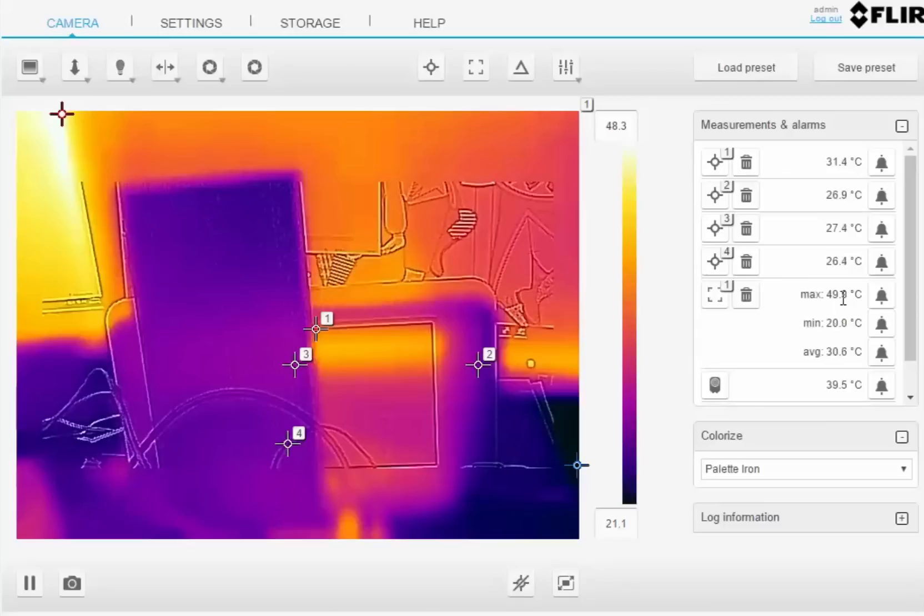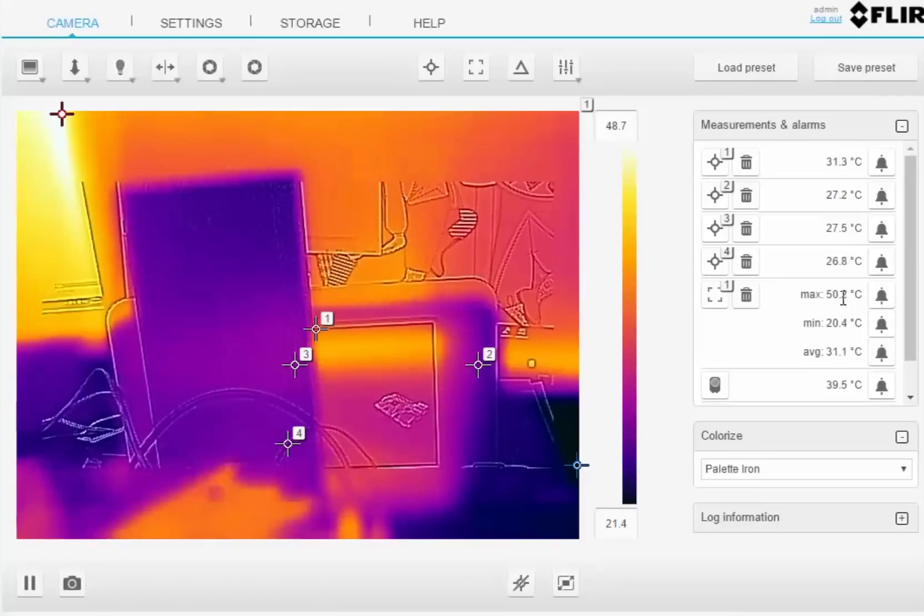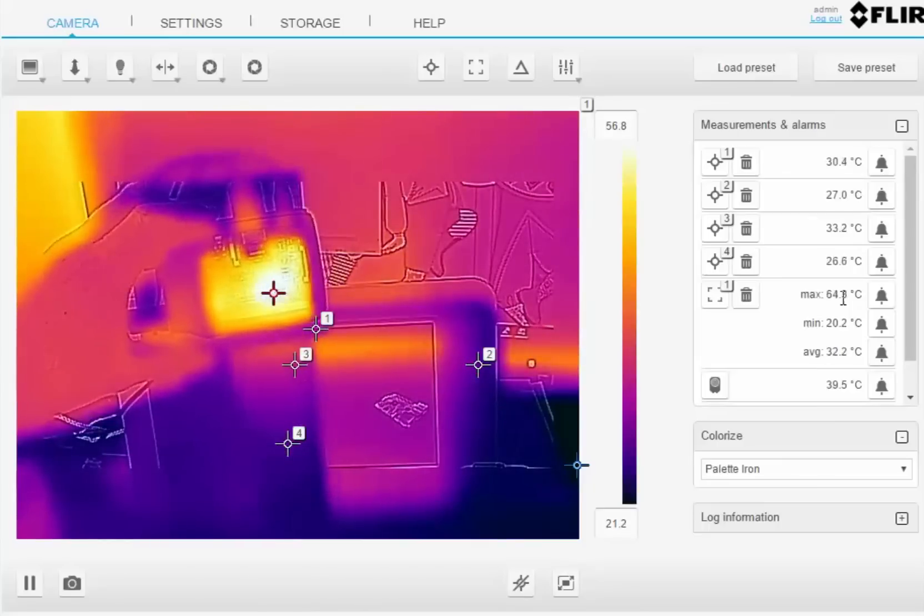So I think this shows that if you are going to be heavily loading your Pi — and I mean heavily loading it — then it would be prudent to put maybe some heatsinks or certainly make sure there's plenty of ventilation around the CPU with either a fan or something like that. For most of us that don't run anything to that level of CPU usage, certainly not for extended periods of time, then it probably still would be fine. The other way to keep it cooler is to artificially limit the upper CPU frequency by changing the boot config.txt file to limit it to 900 MHz or even a gigahertz, just a bit lower than the maximum.